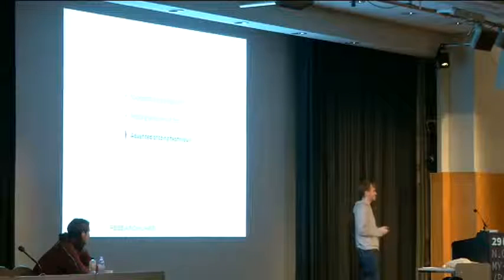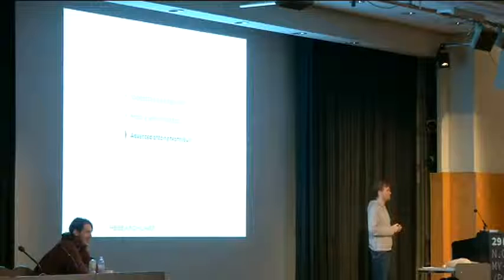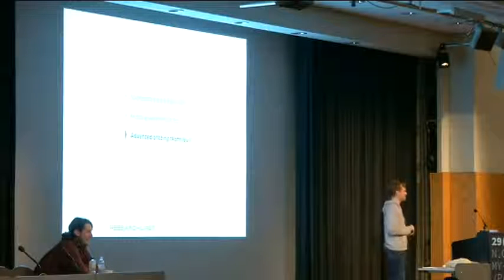So let's look for the remaining couple of minutes at how to overcome the restrictions of this setup with more professional setups. This setup would run into two dead ends. First of all, chips get increasingly small in terms of feature size. So the structures you're trying to probe get smaller and smaller over time, and especially with the scratching, you don't really get through to these tiny structures anymore without destroying a bunch of other stuff on the chip. The second limitation is that some chips actively try to fight this kind of probing with defense structures, and those, of course, are built with setups like this in mind, and they are pretty effective against them.